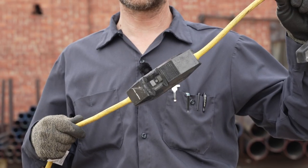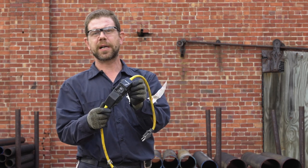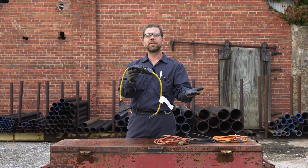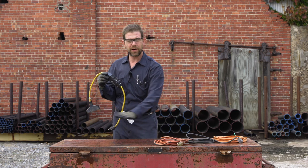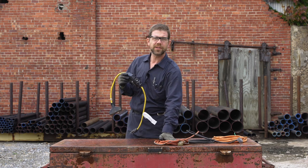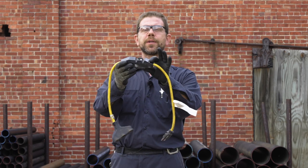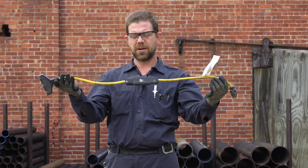Here's one — it's got the little pluggy bit on one end, some tags that tell you what not to do, a box in the middle with some buttons, and a regular 110-volt 15-amp outlet on this end. It's exactly what it says: a ground fault circuit interrupter. If you have a wire in your extension cord run across the floor on a metal surface and somebody drives a forklift over it causing a ground fault, this will trip — it's like an automatic switch. If there's a problem with your electrical circuit or a ground fault, this will shut off to keep you, the user, safe.